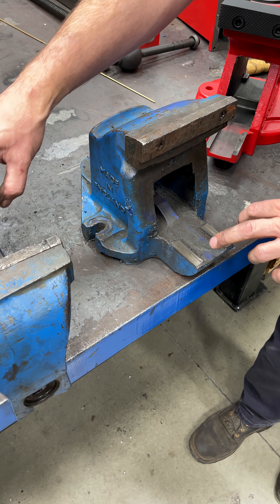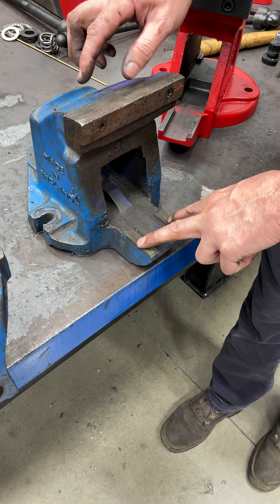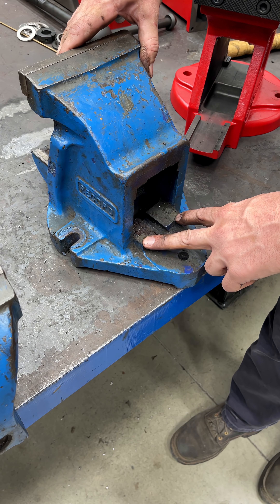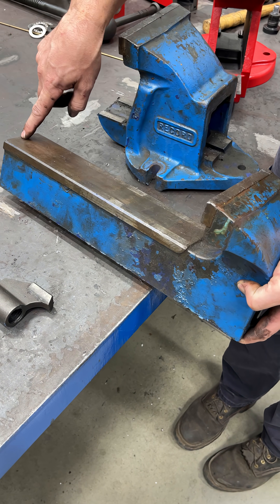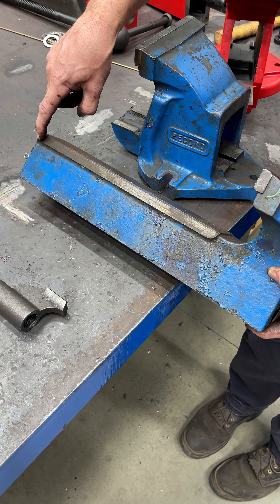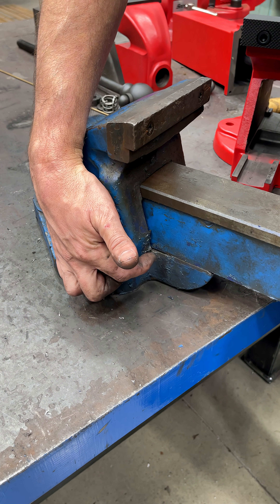So let's look at how the static jaw holds on to the dynamic jaw. Obviously we have the floor — one here on the chin and two little pads here on the back, and that keeps it flat. They have just chosen to have a machined surface on the top and a machined surface on the sides. There's no pad or machined surface down here at the bottom preventing the rolling.